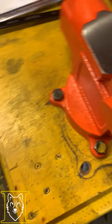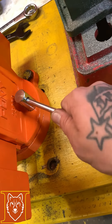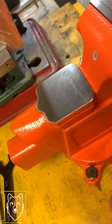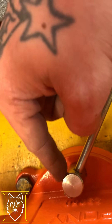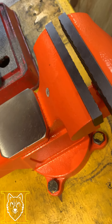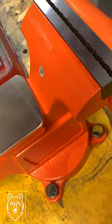The vise is now bolted back down and that washer did fix it. For a better explanation: when I first bolted it down and tightened it all the way, I was still getting some play in the vise - it wasn't even completely on the rotation of the center bolt, but it would still move in and out. Now I've got no movement there. The only play is if I loosen up the swivel base lock - which was not what was bothering me. What was bothering me was the play between the vise and the swivel base, and adding that washer corrected that.